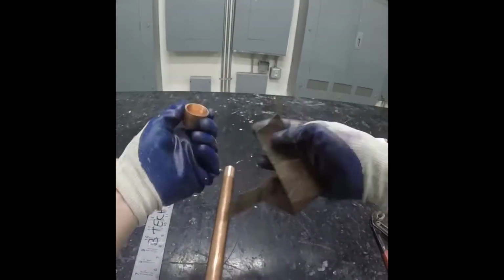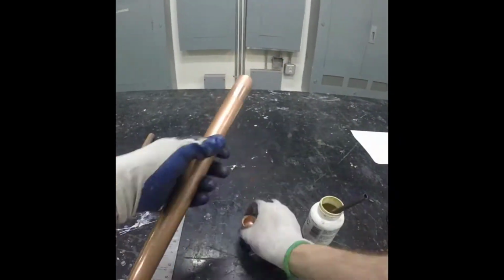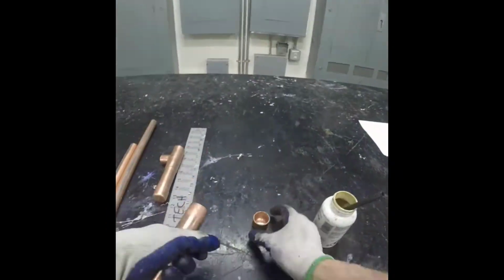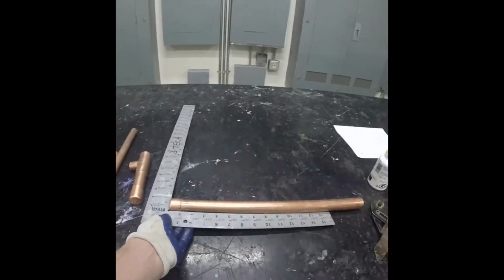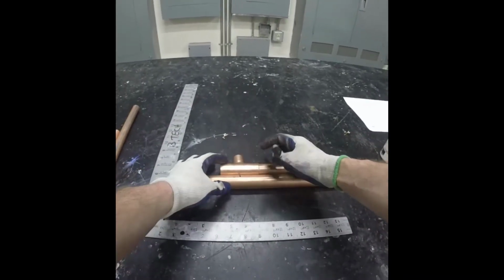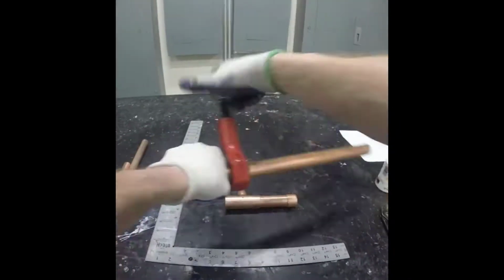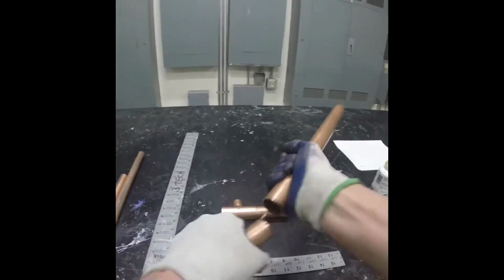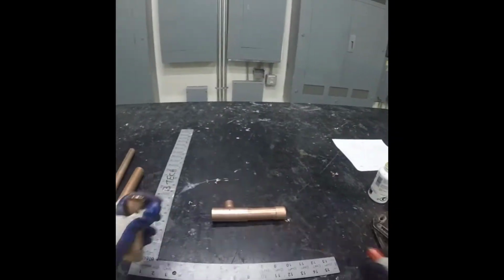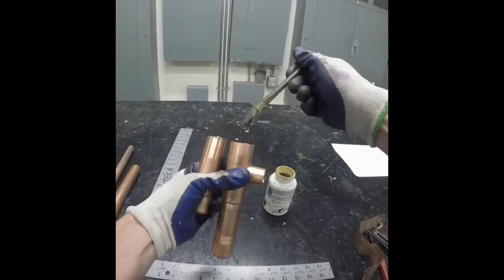We're now preparing the pipe and the fitting, the cap for the other side of the base. Same standard process, other than I forgot to ream, so I had to come back and take care of that. Once again, measuring over using the square, marking center, and marking our cut. Reaming, sanding, and adding flux. The 1-inch portion of our base will soon be ready.